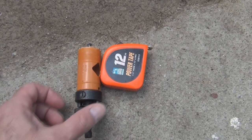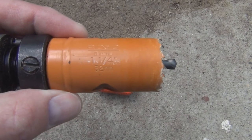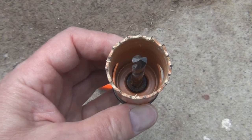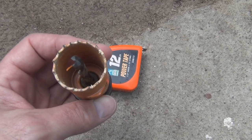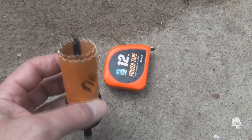So I'm not going to help contribute to the population of house sparrows. The project I need to do is get a piece of wood and cut a one and a quarter inch hole in it and cover up this larger hole. This is the bit I have — it says one and a quarter, but it seems to measure one and an eighth for the outside diameter. I think that's close enough — it's definitely too small, I believe, for a sparrow to get in.